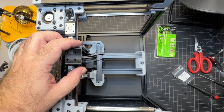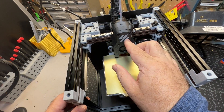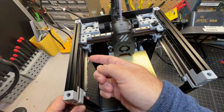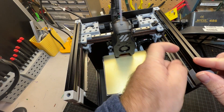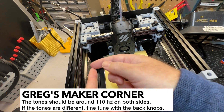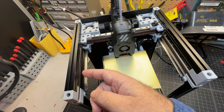There's an app called Piano Tuner which you may want to try if you want to do the hertz tuning method, which measures belt frequency. Move your gantry all the way back and put your head in the middle — you can do this with or without the tool head on. Pluck the belt on both sides and hold your microphone as close as possible to the belt, then look at the tone in your piano tuner app. You want that tone to be around 110 hertz.